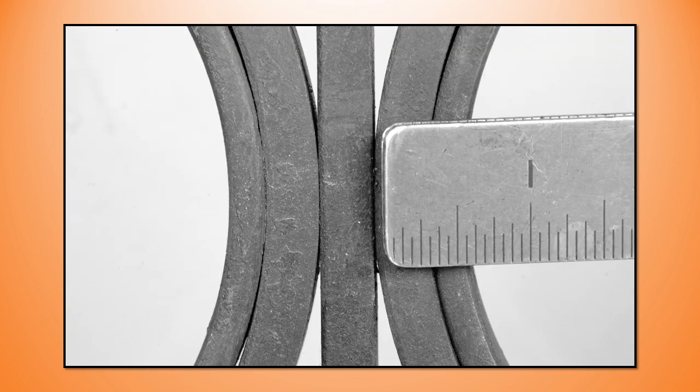The typical place to start for the wrap collar is adding the perimeter of the material to be collared to twice the thickness of the collaring stock. Some say 2.5, twice works for me. And that might seem easy enough, but there's a couple of other factors to take into account. First, the perimeter of the material to be collared. As these are scrolls, you're going to notice that I've got some air gaps here. And this, my rule is 1 inch, the same width as my collar. So you can see I have to factor those air gaps in when I'm taking my measurement. So my measurement goes across here, not just a sum total of every bar that's involved. Got to include the air gaps.